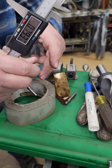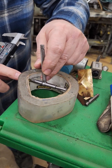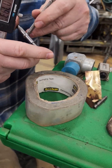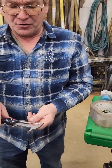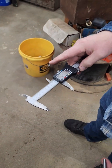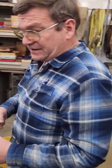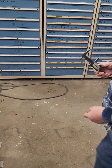When using the telescope gauge in a regular piece of tubing, you draw it through one time, letting it center. Imagine that you are trying to pivot around the one held end and let the second one center, pushing it into its smallest point. Then you can take it to your calipers and feel to where the caliper moves out the furthest amount, and that'll give you a pretty good measurement.